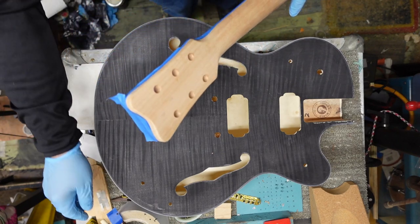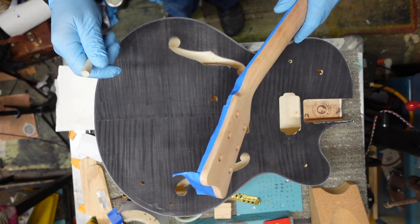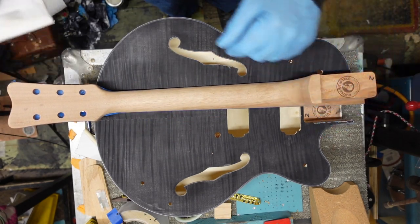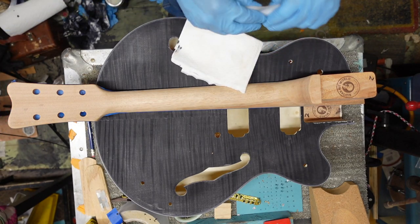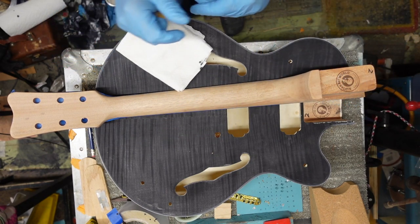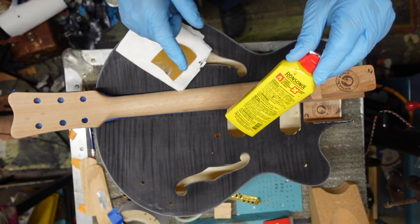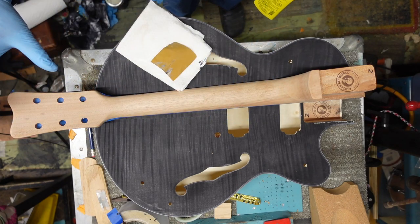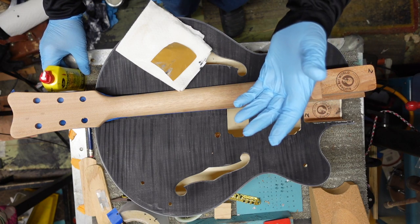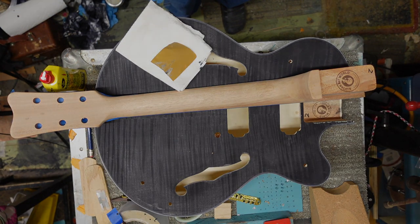And when we apply the oak gall ink this time, we're going to use a little brush instead of ragging it on. The procedure is going to be the same. We're going to take 400 grit paper. We're going to go over everything. We're going to use the wipe all rag. You've seen this before. And then once that's all done, we are going to use lighter fluid to get everything, everybody, fingerprints, oil, whatever's on here, we're going to get that off. Notice I have the gloves on already. There's no sense in putting more fingerprints on it. But same thing, I'll show you when it's done.